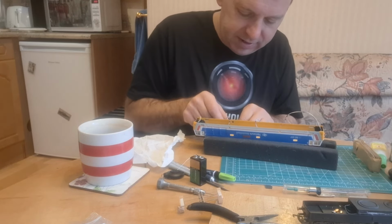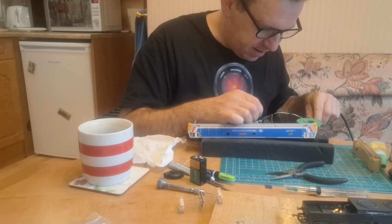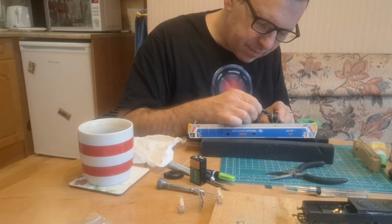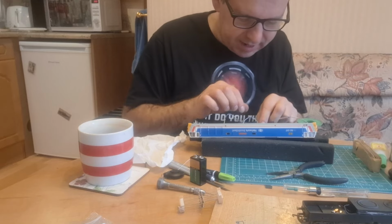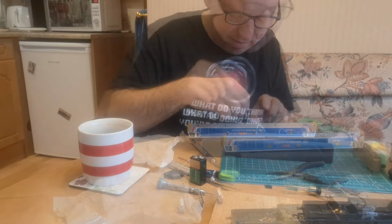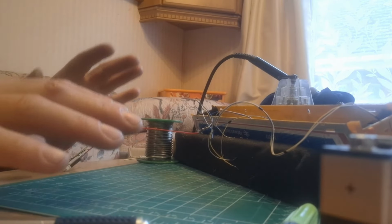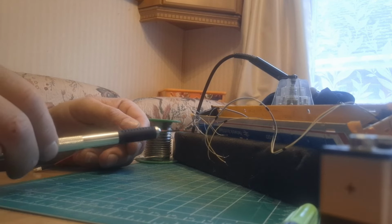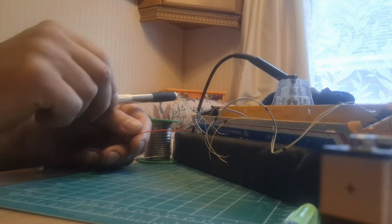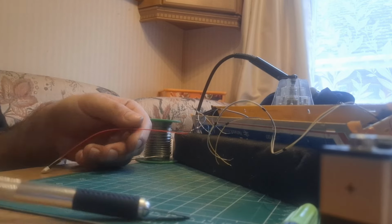So we can... We're working left-handed now. Oh, that's hot. But they are together. Right. That's the common positives all together. Let me change the camera angle, get you in here a bit closer. Okay, closer. You see my red goes to these two resistors, which power those two end boards, and these two other blues which have their own resistors, which do the yellow ones up the top.